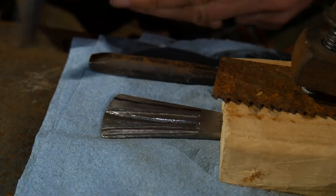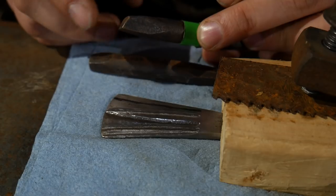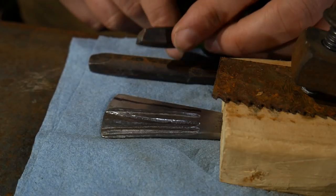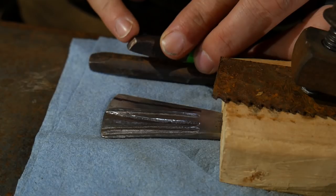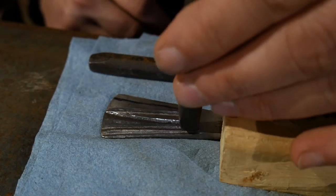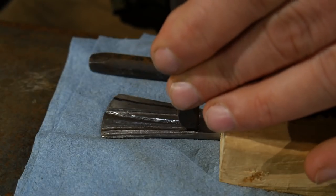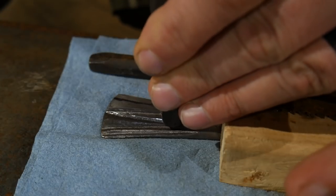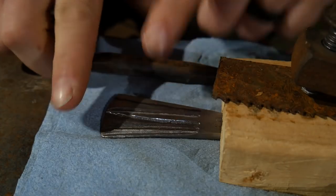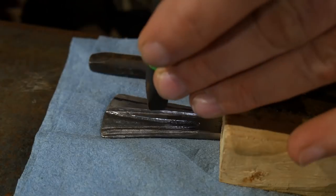We are using a butcher tool — a single edge butcher tool. Butcher refers to anything that has a leading edge, meaning it pushes away material. The material gets pushed away via this surface and then it cuts down through the piece. Basically, you want to strike yourself a mark for a center vein, and then come down with this tool and just hammer straight down, just like as if you were chiseling something off. This essentially pushes the background away from this center ridge. You want to use the flat side of the tool against your layout line as you come across it.